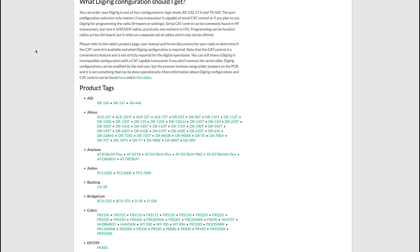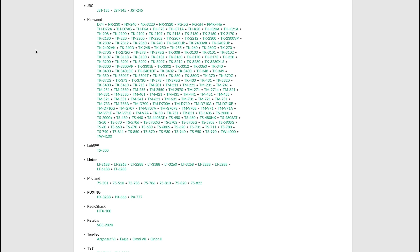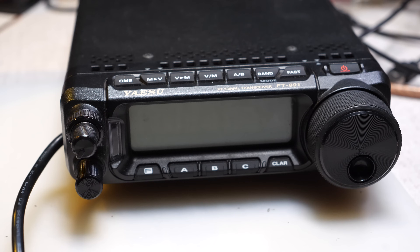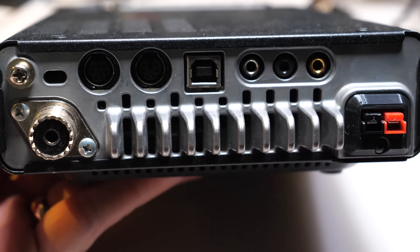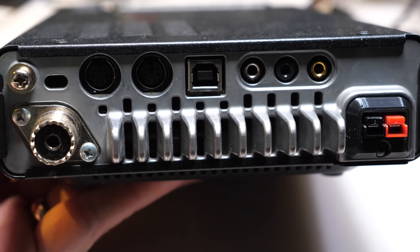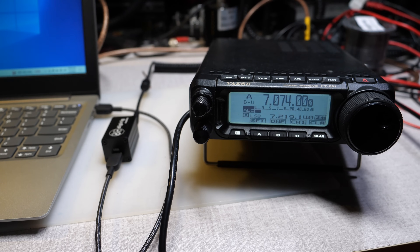Perusing the online store, you'll see it can support a wide variety of transceivers, even those without computer control. Today we're going to focus on the Yaesu FT-891 and how the DigiRig interfaces with it. The Yaesu is slightly maddening in that it has an integrated USB port, but this port is only for CAT control — there is no internal sound card in the FT-891. Because digital operation is split between the USB and the data ports, using this rig on digital modes becomes a bit sloppy. The DigiRig overcomes this by using serial RTS signaling to toggle the push-to-talk, so a single cable can deliver audio and PTT without dealing with multiple drivers.